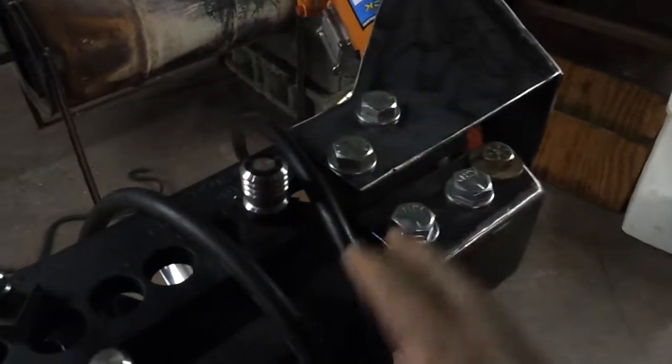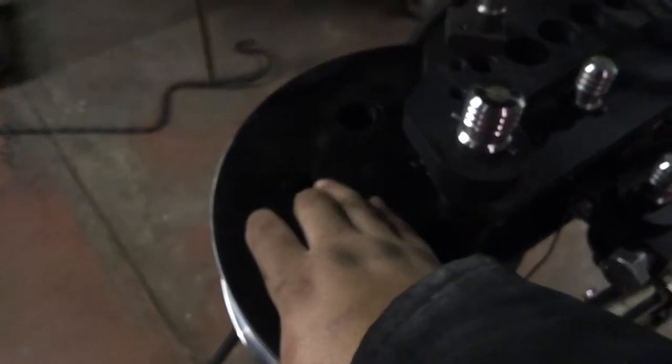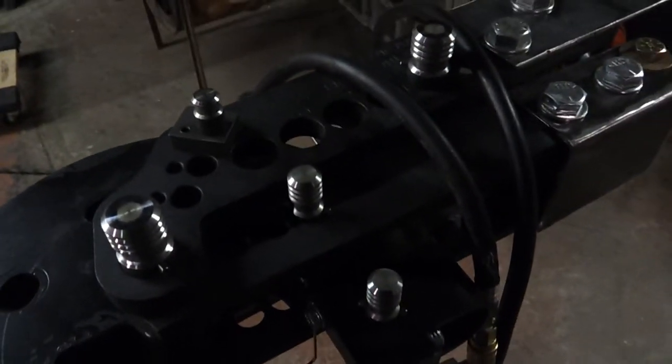Right now it's not in the hole, but when it gets to the hole it drops down. When you need to reset — collapse your ram and start over — it'll hold your die set and the tension on your tubing while you reset this pin. That makes sense. If it doesn't, keep watching, you'll get it hopefully.